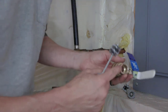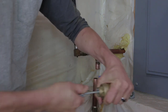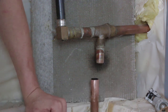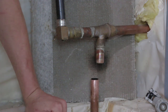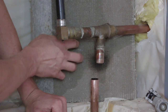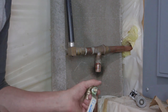We sand the pipe down to get nice shiny copper, then clean out the inside of the ball valve on both ends using the brush - get things nice and shiny in there. I had to run the torch for a few minutes to remove a big ball of solder left from the original installation, then hit it with sandpaper again. One thing to note: I've got a piece of cement board behind here - when working near plastic vapor barriers in an unfinished basement, cement board helps protect against fire or melting.